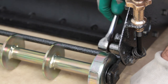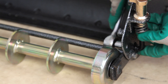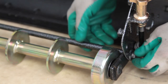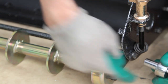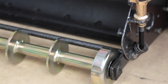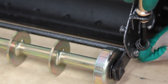I'll probably go a little bit further on that one. It's still turning, so what I want to do is make sure I don't immobilise the front roller altogether by doing this up too tightly. Same with these little bolts — we just want to make sure they're backed off enough so that this thing can pivot of its own accord. So that's good.